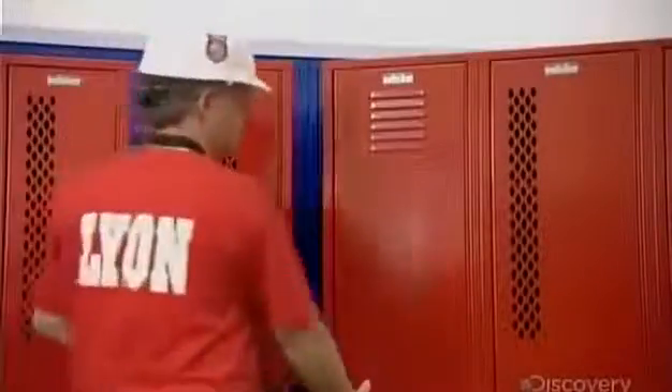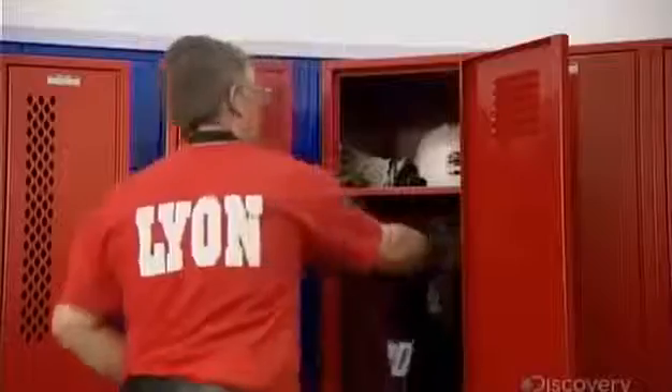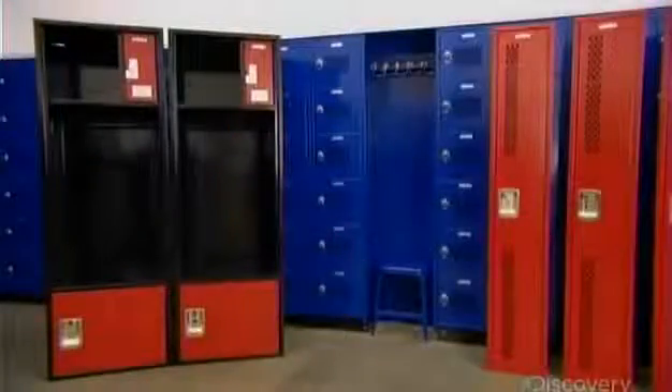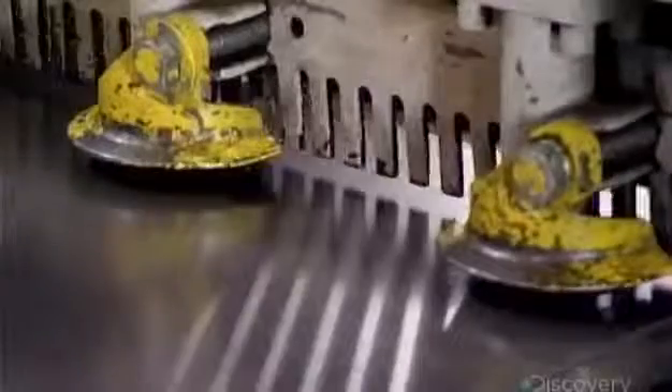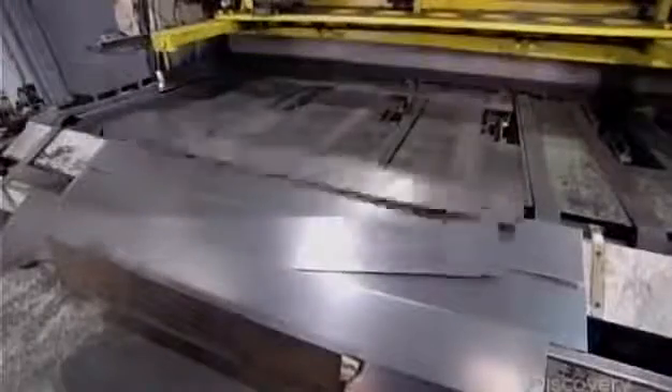While they vary in size and design, all lockers have ventilation holes. These help air circulate, which prevents odors. Lockers are made of a hard type of steel that's just flexible enough for presses to bend to the required shape. The steel sheets are 2.5 millimeters thick. Workers feed one at a time through a cutting tool called a square shear, which slices from one end of the sheet to the other, cutting pieces with the required width.